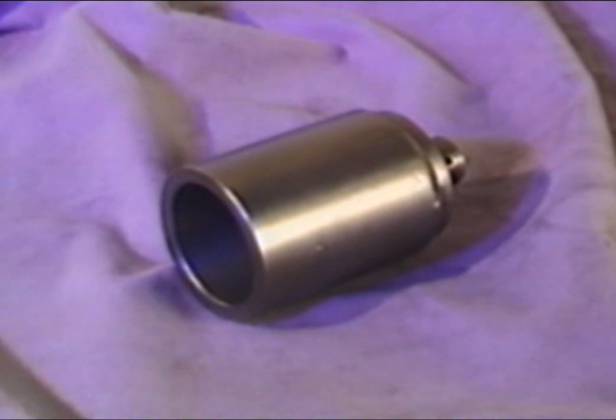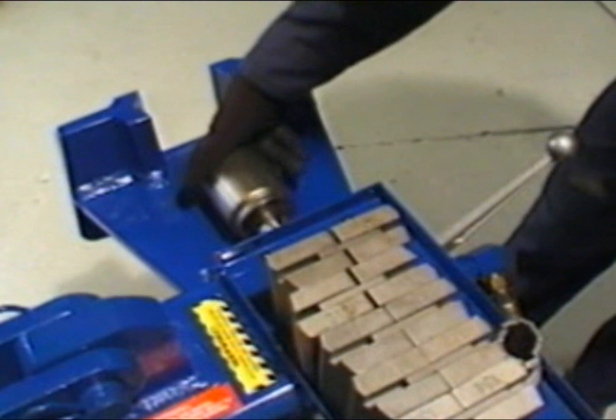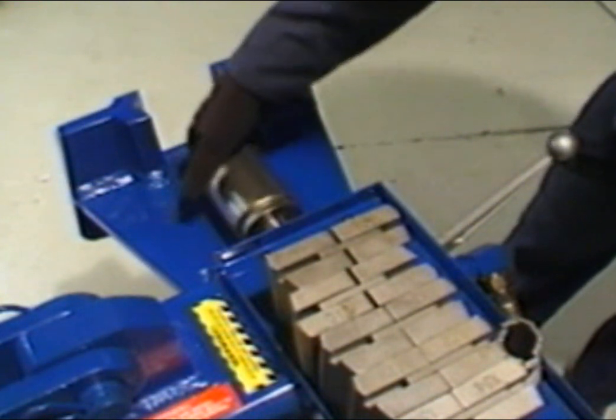Reducing tools are used for reducing or shrinking pipe ends to exact outside diameters. Each tool is marked with the appropriate size. It is important to understand that the size marked on the tool will be the size that the tubing will be reduced down to. Reducing tools are not included in standard tooling packages. Before proceeding, make sure that the inside of the reducing tool is lubricated thoroughly.